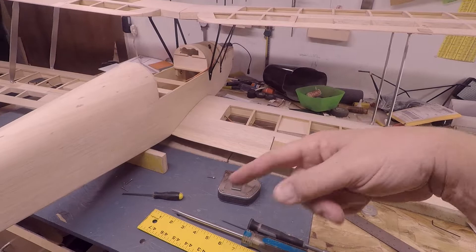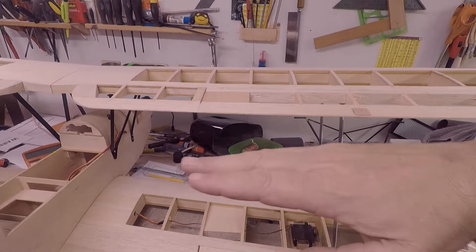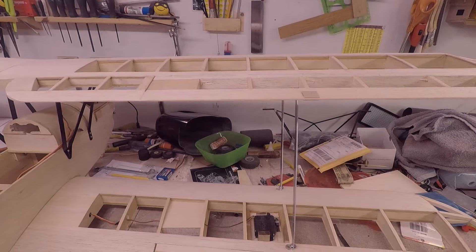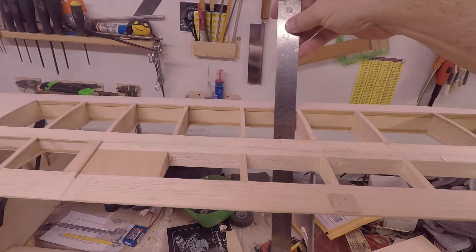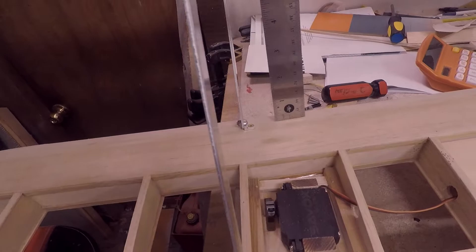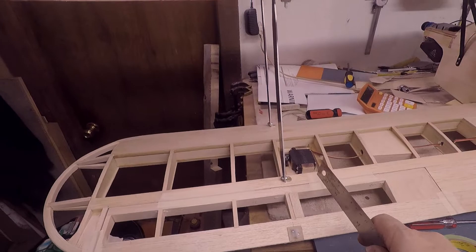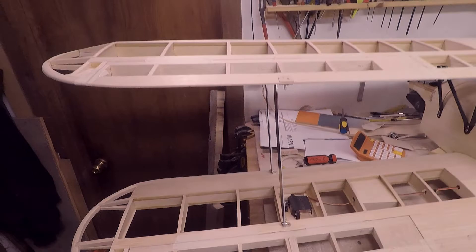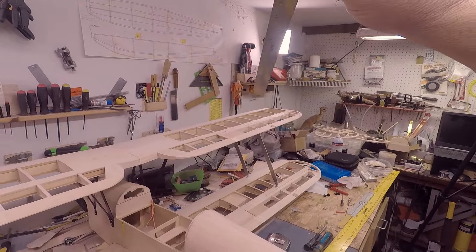What I did was come in right from here and measured back to here to make sure that the bottom wing was 90 degrees to the fuselage. Before I even started getting the top wing situated properly at this type of angle - the X axis twist, whatever you want to call it - I had to make sure that I got the height correct. So the first thing I did was get everything dialed in, and this one comes in sitting at 11 and 7 eighths. I did the same exact thing on the other side, measuring from the little mount for the bracket for the interplane strut, and this side was 11 and 7 eighths as well. That made sure that this wing and this wing were parallel to each other. Then I made sure the wings were level, measured from pretty much the tabletop - it was 15 on this side and 15 on that side. So I knew everything was true with the height.